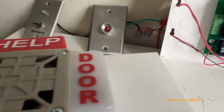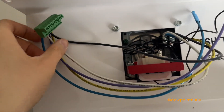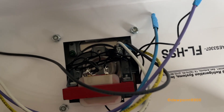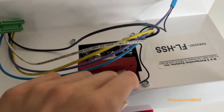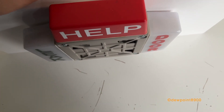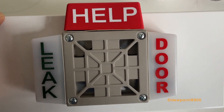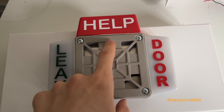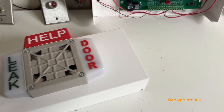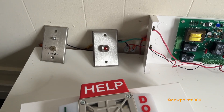There's a terminal block here that connects to the appliance. On the back you have your model number — that's all HSS — and this connects back to the circuit board. You've got the standard 31T horn behind it. This appliance isn't all that old, and while the 7002T has been long discontinued, the 31T looks like it's still used for more general signaling purposes. It's not every day you see a 31T with three different strobes on it, especially one with a red strobe. That's pretty much it for this demonstration — a pretty cool appliance that uses a familiar mechanical horn, especially for people in the following community.